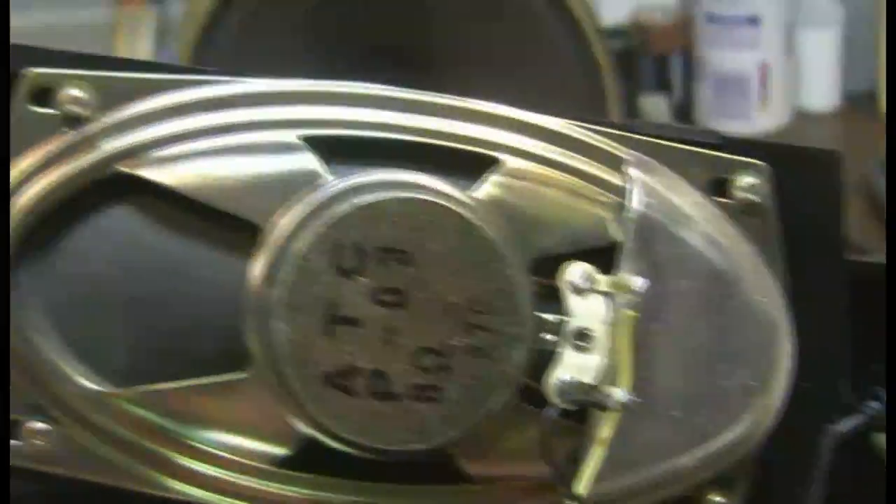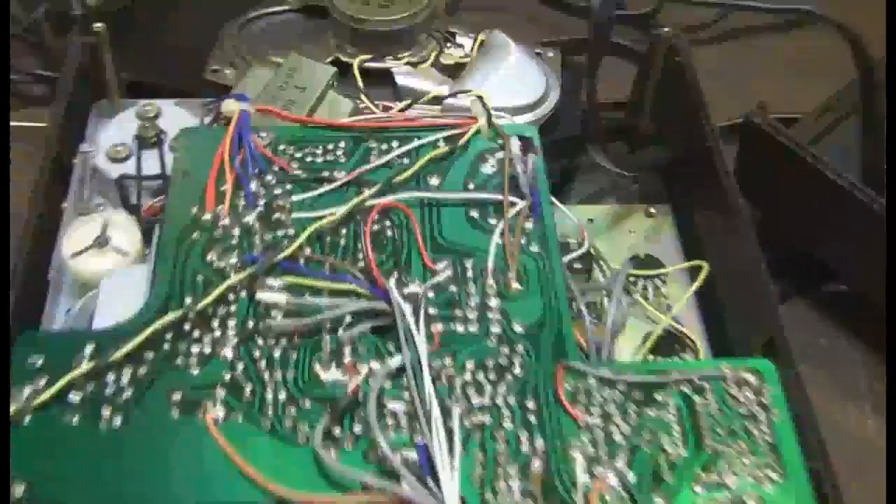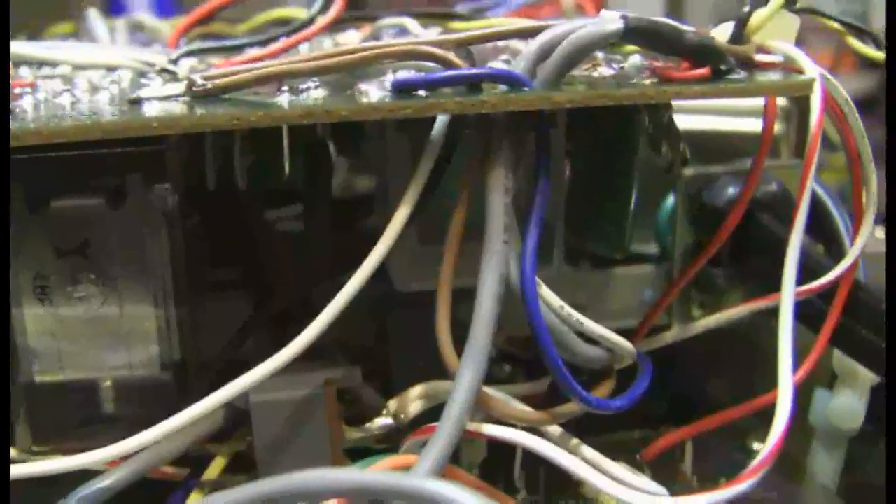I heard something loose inside, so that was all the temptation I needed to take it apart. Cool looking speaker — big oval speaker. It's got a shield on this side so where the power cord tucks in won't hurt the speaker. The power transformer, motor — if you're looking here, a little black round thing. Here's your bias oscillator, so it is AC bias. Big mess of wires — it's not the neatest looking thing on the inside, but not too shabby. Big relays in there for controlling the projector.